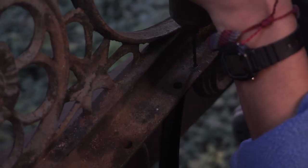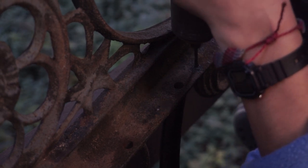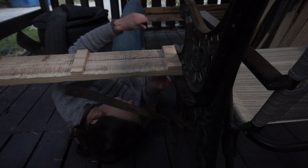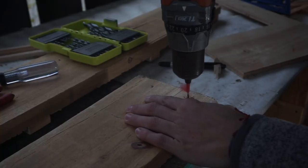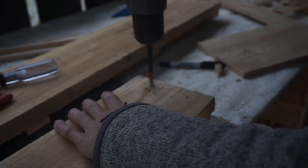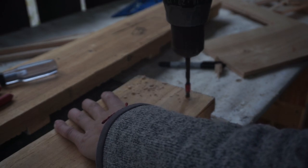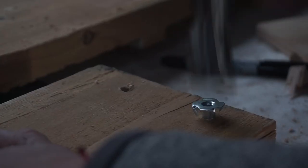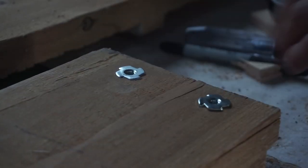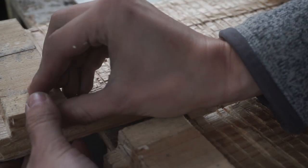With the tires cut, I drilled out some more holes into the sides of the bench and then did a quick dry fit to make sure everything was going to line up. I decided to attach the wood crosspieces to the sides of the bench using t-nuts, so I got those installed. I cleaned up the wood a bit because the hammering had cracked some pieces, so I used a mixture of sawdust and wood glue to fill those in.